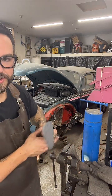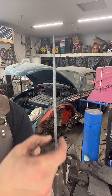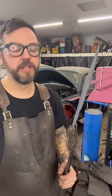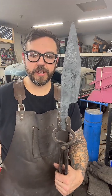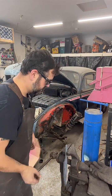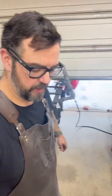We have our distal taper. Turn it this way so you can see how it's thick here and gets nice and thin towards the tip, almost kind of disappears. We don't want too much to disappear before heat treat. Yeah, I'm thinking this looks pretty good. I'm pretty happy with that. We're gonna hang it up in the vise for now, and we're gonna turn the forge off. While I'm doing this, if you guys have any questions, put them in the comments.